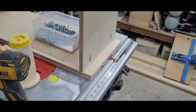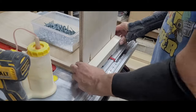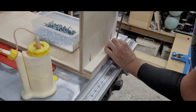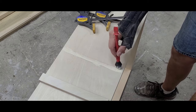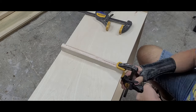I'd like you to think that I have a plan in mind before I begin building. Well, the truth is I start with a sketch and kind of build as I go. If I actually planned this out, I probably would have set the bottoms in dados, but I didn't. So plan B is adding a few cleats to support the bottom — these will all be hidden by the face frame. They were set flush to the front edge. A bit of glue on one side and one edge, and the cleats are fastened in with a couple of screws. I put one of these cleats on either side, and then just glued and clamped a third cleat in the center — just in case.